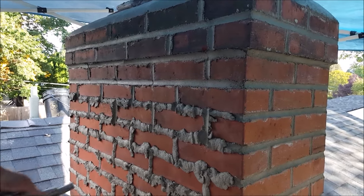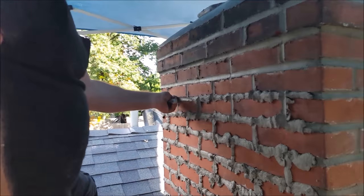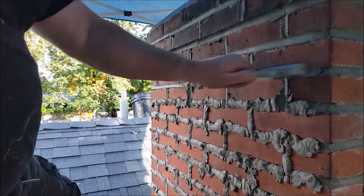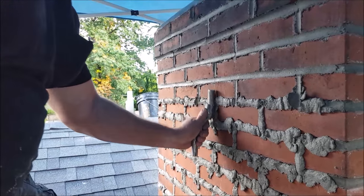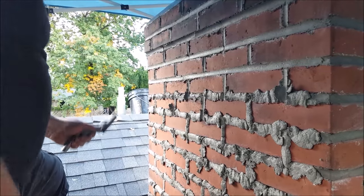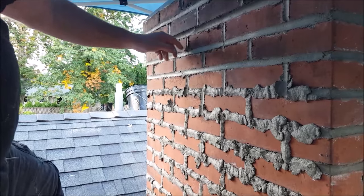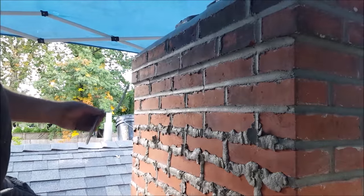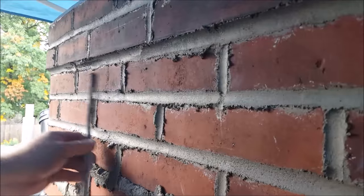I have a motto — it's called 'don't fight the strike.' What that means is strike it at the exact right time, and when the mud's set up exactly right it'll be an easy job. You'll get a nice smooth finish — that's critical. At this point you let it set up a little bit more and you'll see this extrusion on the sides. You let that set up a little bit more, then get a straight edge — a small trowel, a striker, something — and you trim it.